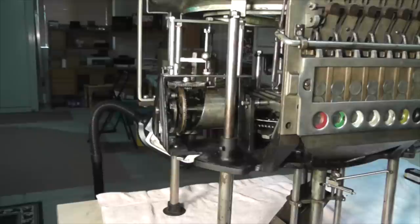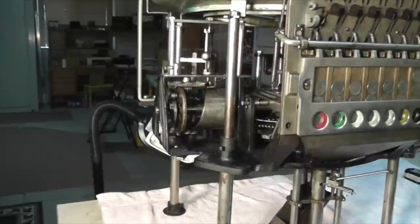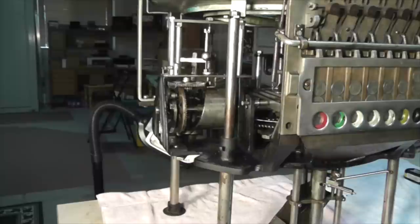You'll see a couple timing cams. This large one here is what resets the payout lever bar, which has its own timing wheel and timing clock. This cam here will stop the timing once it has rotated, I would guess, about 220 degrees, a little bit more than halfway, and the rest of the cycle will not occur until the ball detection lever